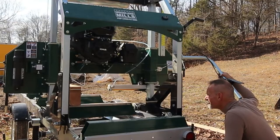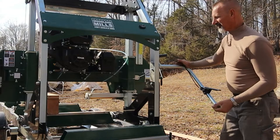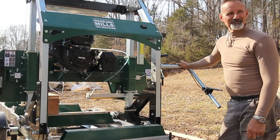Right there would be an inch. I want to plane it, get nice clean sides, and make it a little bit thicker, which is what I'm going to do. Although, if I do an inch, that's a pretty big board. Still have about 5/8 if they're running through the planer, so it's still a pretty decent size board. So I'll leave it at an inch.